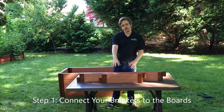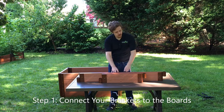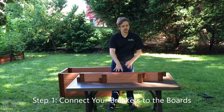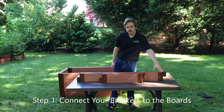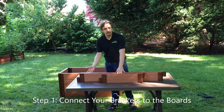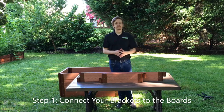When bracketing your four-foot and two-foot timbers for the 2x4 design, make sure that you install all brackets in an alternating orientation for both your two-foot and four-foot timbers. On this side the bracket is in the top position, and on the opposite side it is in the down position. Make sure that all of your boards are connected in exactly this pattern.